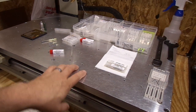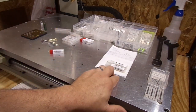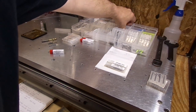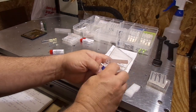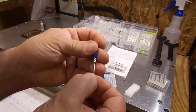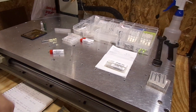So those are the tools I use with the 6040 — ZRN coated on aluminum, love it. The uncoated stuff goes away for plastics and wood. I've also got a one-fluter here, basically for acrylic — it's a one-fluter with a spiral point so it can plunge in. That's supposed to be for acrylic and you've got to run those really fast with high feed rates, like 60 to 80 inches per minute.